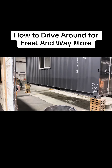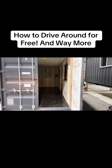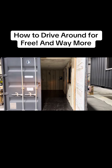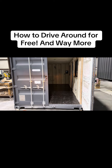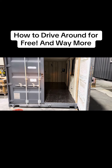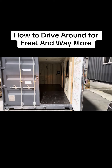So it's serious insulation any way you stack it — we've got the best insulated containers in the market by far. And why that matters: condensation and electricity usage. We are putting mini splits on these containers. We could easily wire for 240, but when we wire 120, the customer can literally plug the container into an extension cord and you've got heat and air, plus extra capacity for TVs, refrigerators, and computers. A lot of people don't have 240. And with SEER ratings of 22 to 23 on the mini splits — double the efficiency of a window unit — you've got 7 or 8 amps left over for other equipment.